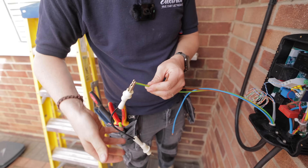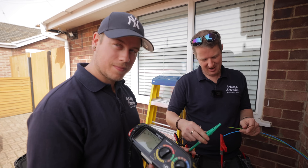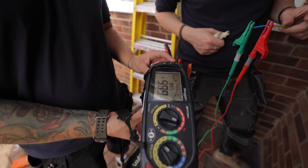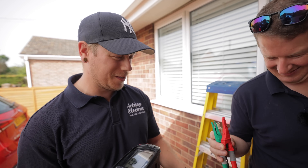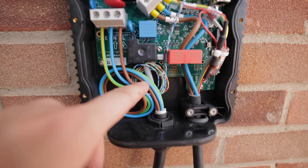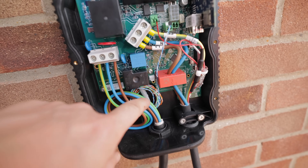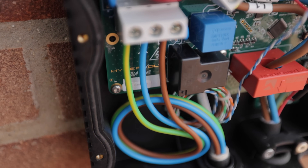We're doing the earth continuity test - R1 and R2 - linking it out here and testing at the other end. Our lead's just rocked up, better late than never. I've got my CT connections in, and I've coiled up the extra data wiring so that if we wanted to do hardwired ethernet later on we can put an RJ45 plug on the end and plug it in. The power cable is 4mm high-tough going into those terminals.